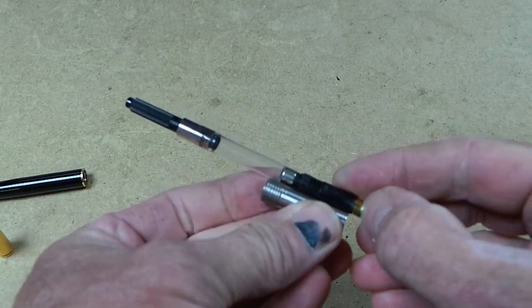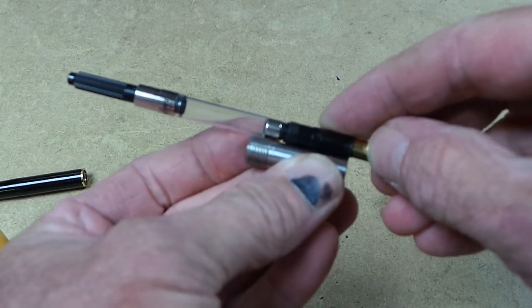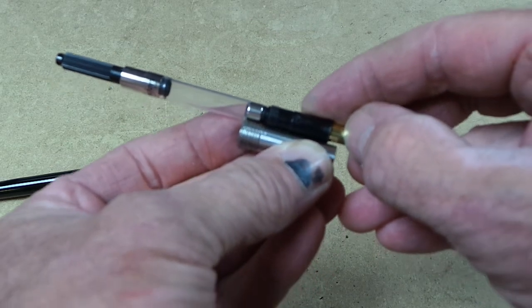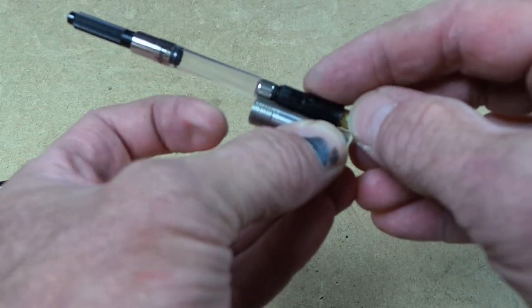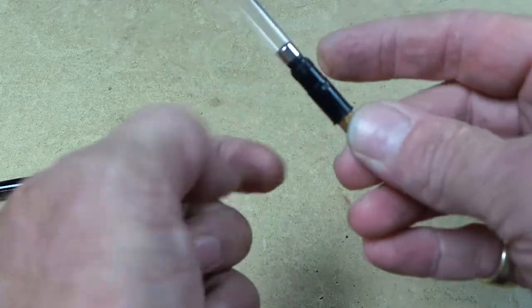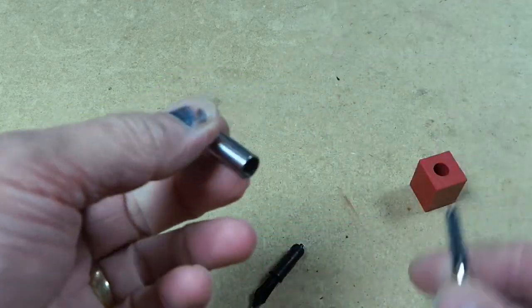If it's full length, you've got a converter. That's where the housing sits, and you can see where the converter is going to push into. If you reduce it, obviously it's going to sit a little bit further down, but by reducing it 3mm, you're still not running out of thread here, and there's still ample inside to take the converter and to give the converter some support by being in there, so it's not vulnerable to getting knocked around.